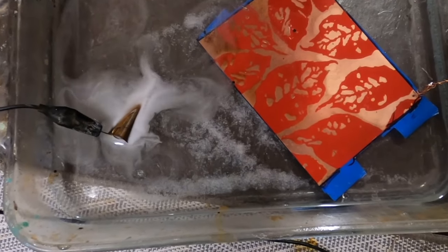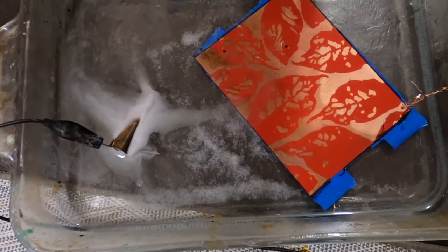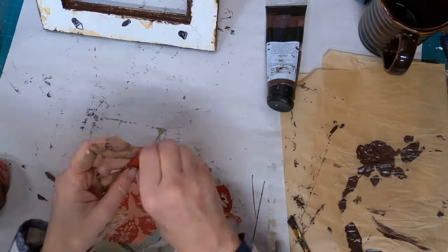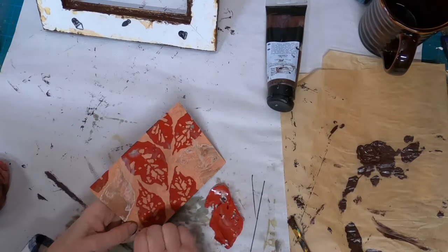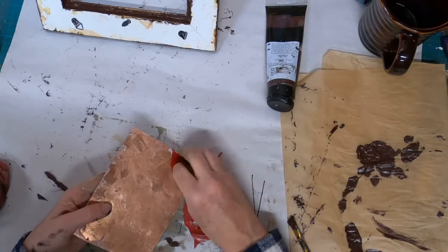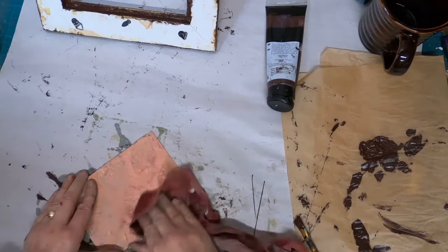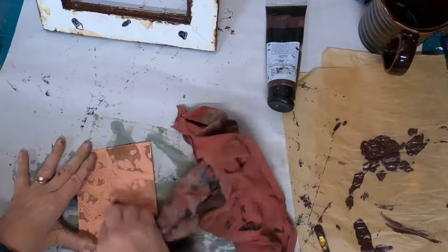The bubbling tells me that it's starting to remove the copper. After about 10 minutes you can see all that copper in the water moving from the positive to the negative charge. After approximately 40 minutes, I've pulled it out, rinsed it off, and put it in a baking soda and water solution to stop the etching. I'm now pulling off the vinyl, and you can see the relief I received from the 40 minutes. I'm cleaning this piece up, removing all the saltwater, rinsing it well, and getting it prepared so I can darken the areas that are etched.